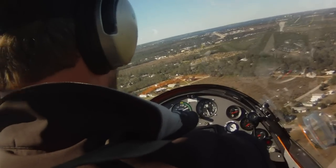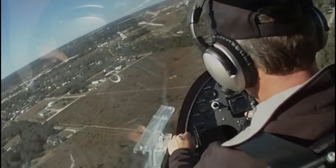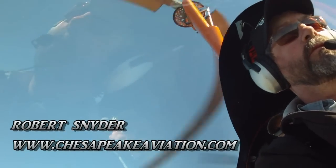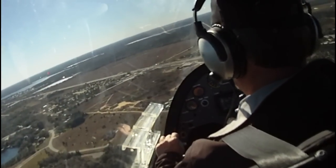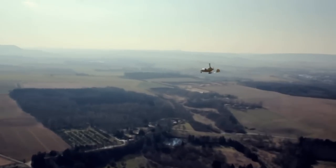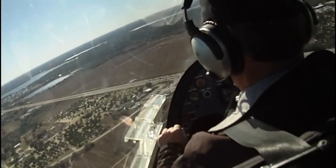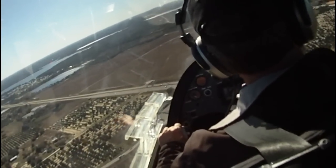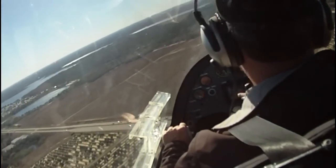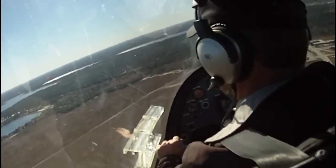What kind of speeds do you see in a gyrocopter? It depends on propping and how you've set up the airplane. In a flight school environment you might have a flatter-pitch prop. This particular aircraft, set up as it is, was seeing about 85 knots, and one with a coarser pitch prop would see about 100 knots. So typical of the light sport sector — you're seeing 100-knot speeds, pretty reasonable. You can travel a long way; Bob flew from Maryland to Sebring on three legs, about 850 miles total — flying about three hours, 250 to 300 miles, then taking a break. Not much different from what I'd do in many fixed-wing aircraft.